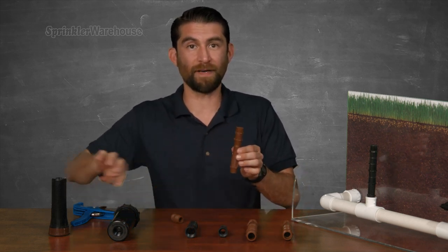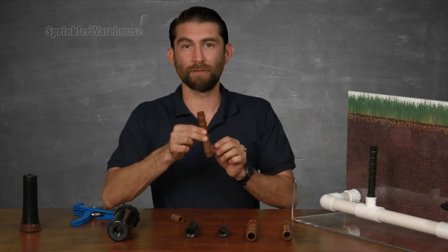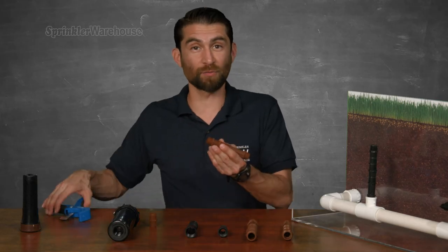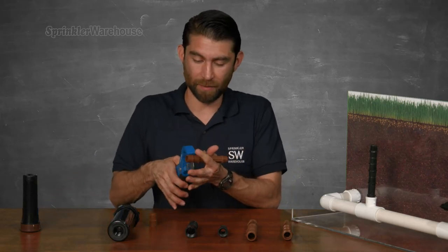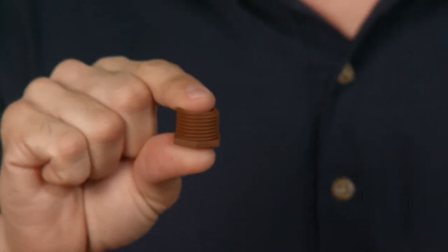And you have this little piece over here that'll give you about five inches of rise over your pipe. If you needed this bigger portion, don't throw away the close nipple — you may need it later, so toss it in with your sprinkler system supplies. Cut off this one section here and now you've got a section that'll give you four inches of rise. And if you end up with a little section that looks like this, you can throw that away — you can't use that for anything.